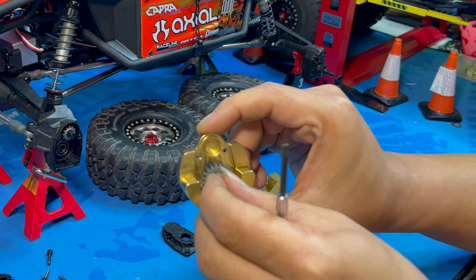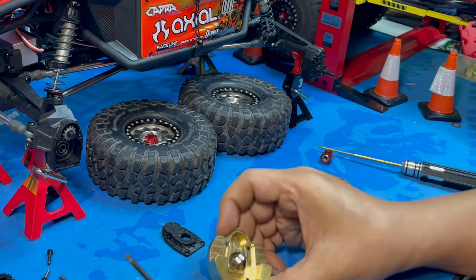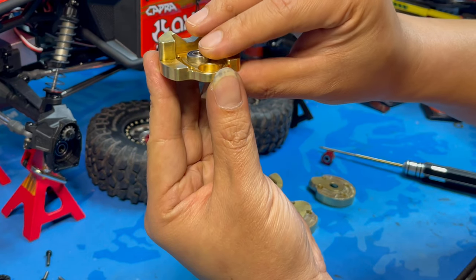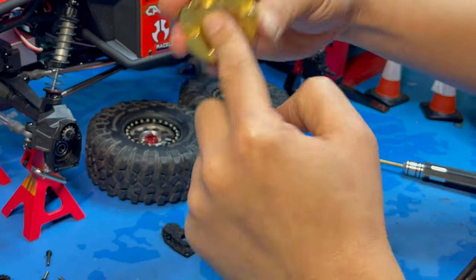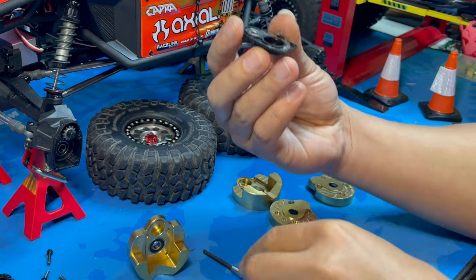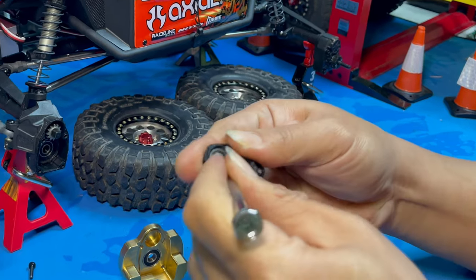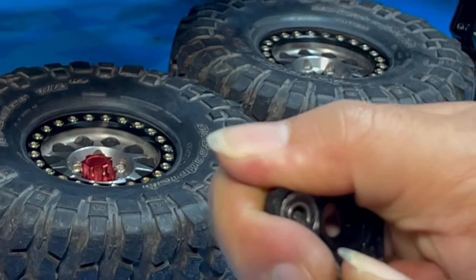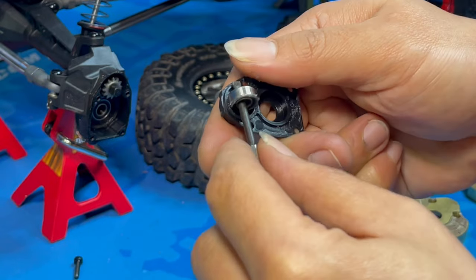To remove this piece it's pretty easy - just push it up and there you go. Before we put the brass in, we have to try first if it fits. Make it flat and then slowly push it in - very sweet, it goes in properly. For the top side, we need to remove that bearing. If you have a spare bearing you may not need to remove this one, but it will come out - just keep rotating and it comes out.